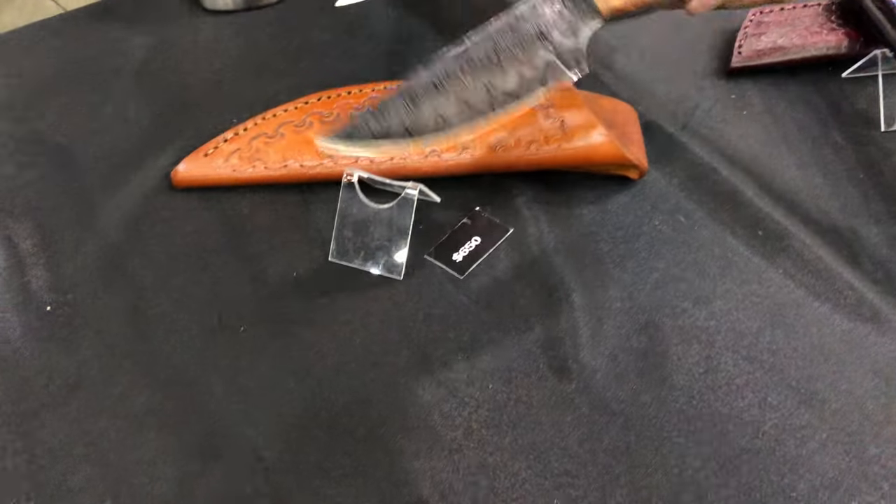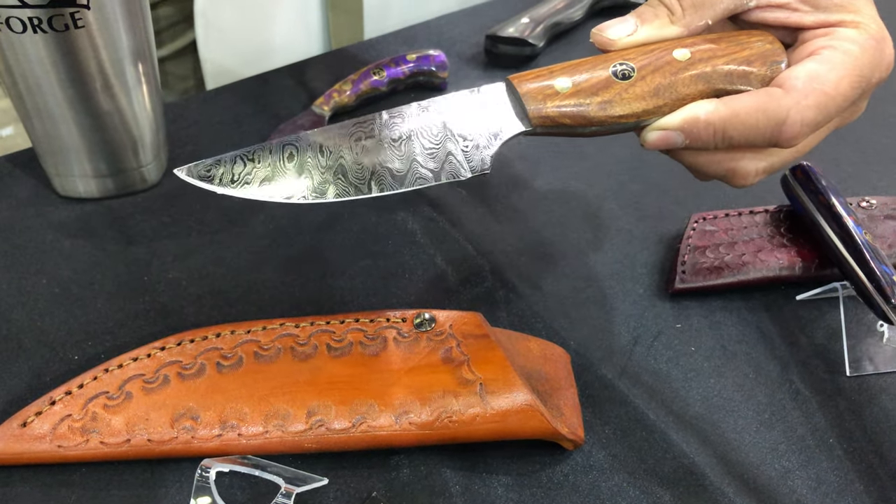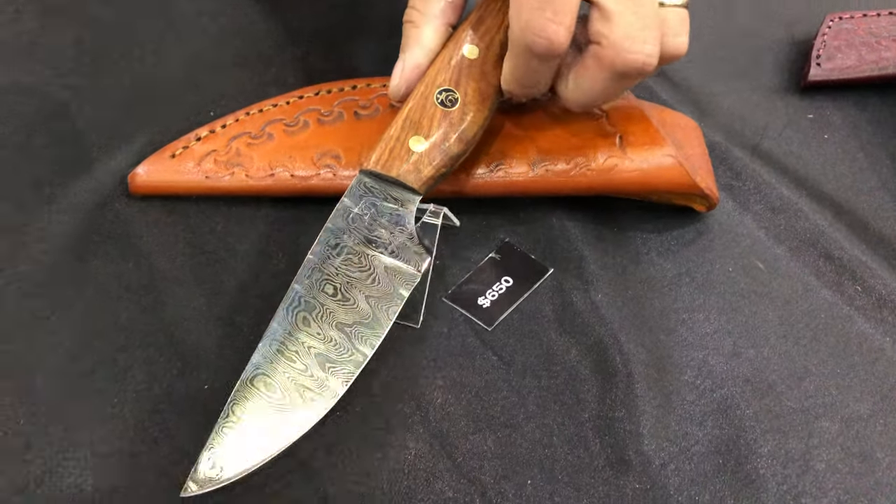With this shark tooth pattern I finally found the sweet spot to put an extra nickel layer so that you get a more defined jaw line down on the bottom of the edge itself. So it gives you a defined shark's pattern.